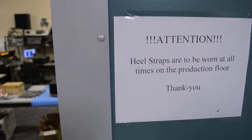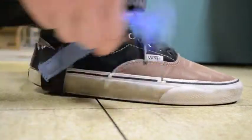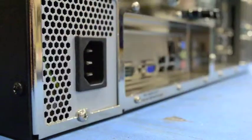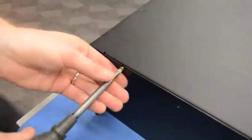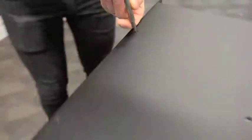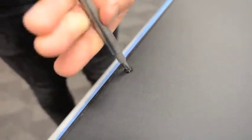It's always important to take the necessary safety precautions. In this video, we are wearing ankle grounding straps. Before removing the lid, the first thing you want to do is unplug the mains power from the unit. Loosen, but do not remove the two screws on either side of the lid. Next, remove the six screws on the top of the lid. You can then lift the lid off the radar or ADA frame and safely place it to the side.